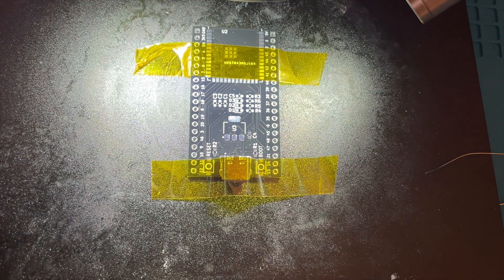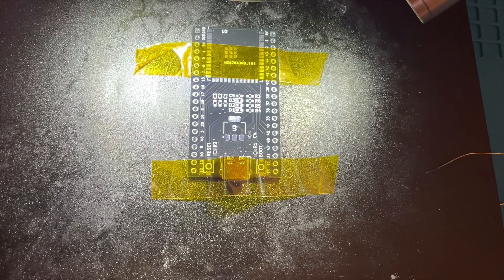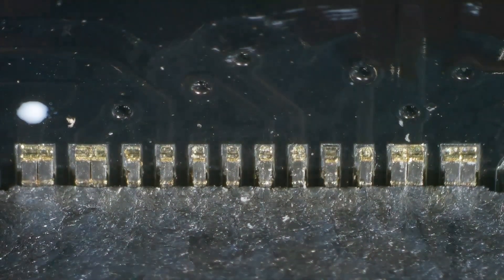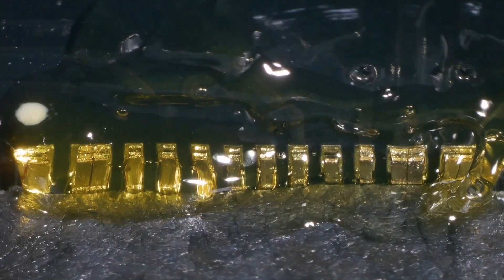So that was using a stencil. Let's do it manually. I've got everything taped up here. We'll do the more difficult components first, so let's start off with the USB socket. I'll switch over to the microscope for this. So we're under the microscope and everything's lined up nicely. We'll add some flux. Now some of these pins will be tricky because there's quite a big ground plane, so we may need to add quite a lot of heat. What I might do is start with some of the pins in the middle and work my way out, so the board will have warmed up by the time we hit the end pins.